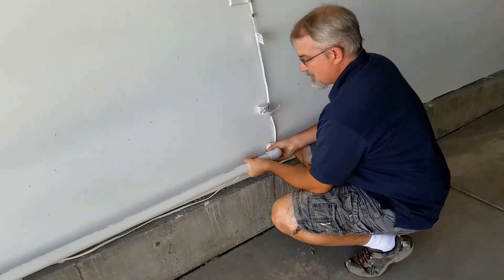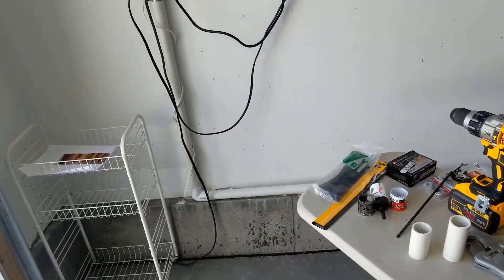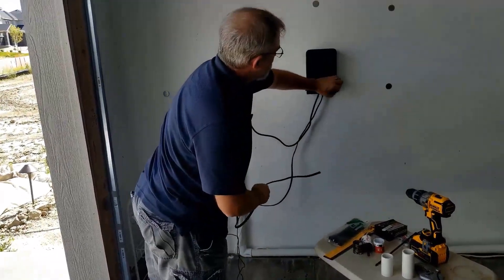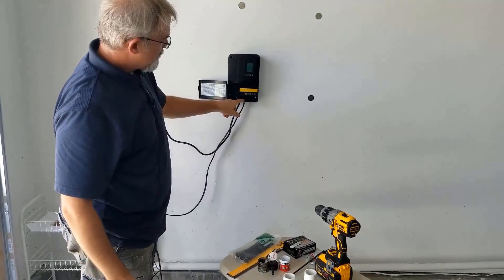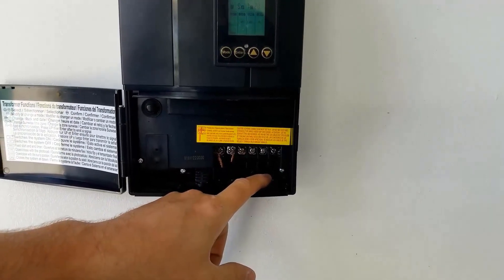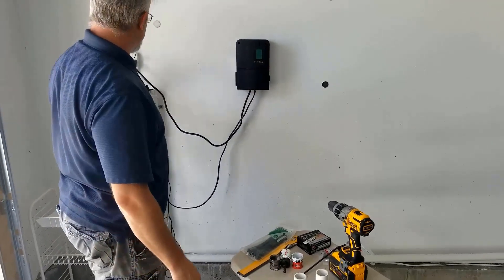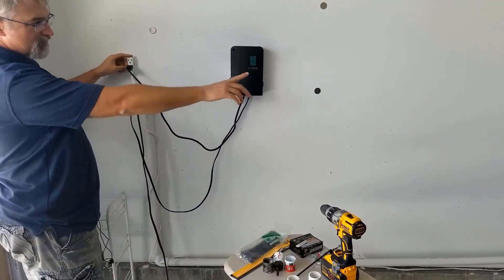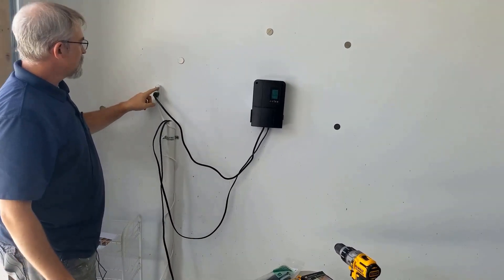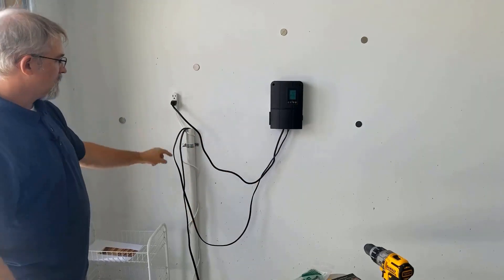Back on the inside, all this stuff comes apart too. Once I get all the cabling through that I want, I'll take this apart and route it bit by bit — which I've already done for the first two zones. I've got one hooked in right now. This transformer is nice because it has three zones, and I'm planning on having five zones just in case, though I'll probably sort down to three. I have my power running here and just ran a cord down — I'll clean this up as time goes on. I'm also going to put my sprinkler controller right here so I can have everything in one place, and I'll route the sprinkler wire in a similar fashion.